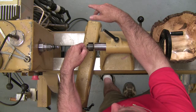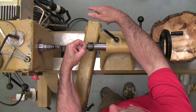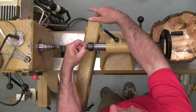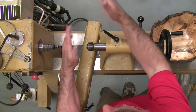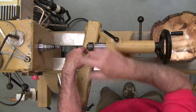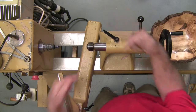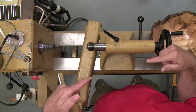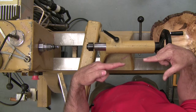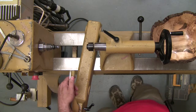And when you're eyeballing it, you're not going to get as precise. Nobody's going to tell anyway. If you look at it closely enough, you can see it, but who cares. And if you look at the wall thickness where it's hollowed, it's not going to be uniform everywhere. When I'm hollowing it with the two mounting places on it, I don't know exactly how thick my wall is there anyway, so I tend to make it a little thicker because I know I'm going to be sanding those off, and I don't want to sand into it.